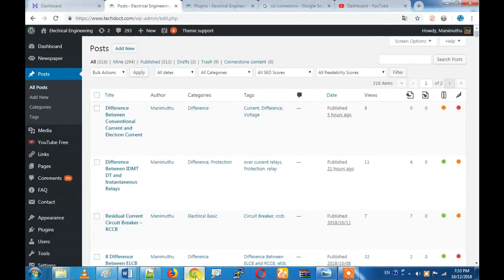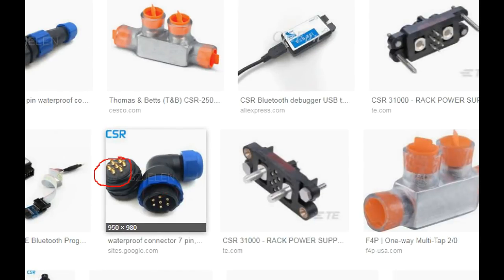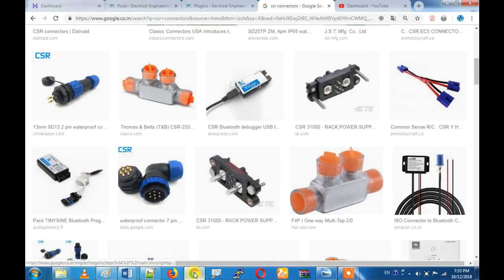Maximum current is 10A — so you can calculate the power consumption. The head range is 70 to 20 meters. The voltage tolerance is 450V, which is the design with 10% margin. QA efficiency and pump efficiency are also listed. Delivery size is 25mm — that is the pipe size. The connection type is CSR thread, so if you want to connect the pipe, use a CSR threaded connection.